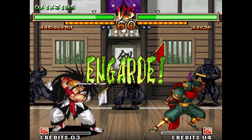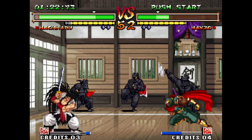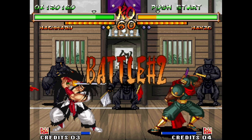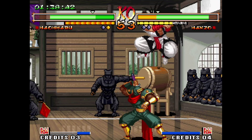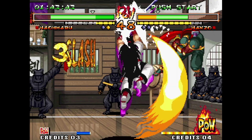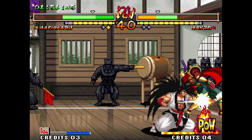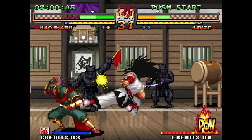As a result, games got larger and more detailed, with smoother animation and plenty of fancy effects, pushing the hardware to its limits in ways never originally thought possible. Even later consoles like the PS1 and Saturn struggled to keep up with it at times, at least for 2D. This was because of its unique cartridges that stored game data on multiple fast ROM chips, allowing it to essentially pull data directly from the ROM and display it to the screen insanely quickly — which is why the cartridges were so large physically. CD-based systems, on the other hand, needed to copy data from the disc in smaller chunks to VRAM before drawing it to the screen, which was a much, much slower process, especially with the slow drive speeds at the time. Because of this setup, the Neo Geo had a surprisingly small amount of VRAM on board — only about as much as the Super Nintendo — because it didn't need to copy graphics data to VRAM first; it pulled it directly from the fast ROM. The VRAM was instead just used to store the tiles that made up the fixed layer and information on how to render sprites to the screen.